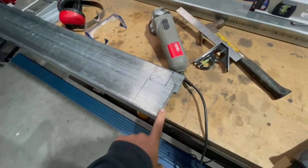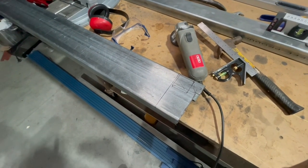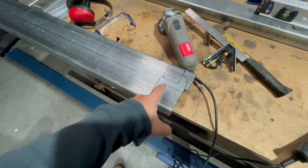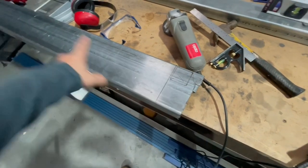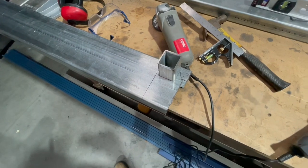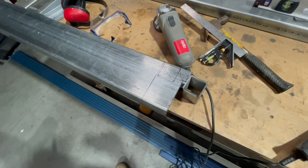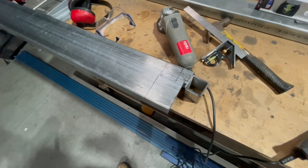Yeah, so that's the piece I just cut out around the fish plate, looking pretty good. I'm going to try something, not sure if it's too foolhardy, but we'll see how we go. I'm going to cut these 50mm pieces out of this chassis member and then weld in this through to the other side. And that's going to be for grey water waste to come through.